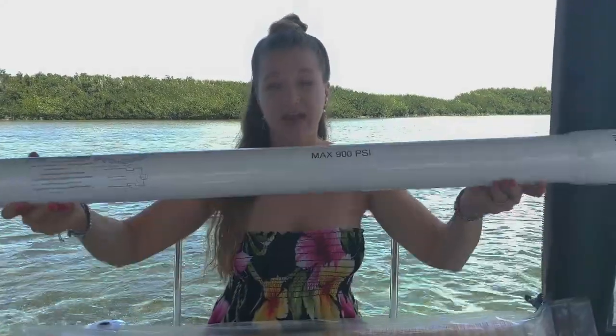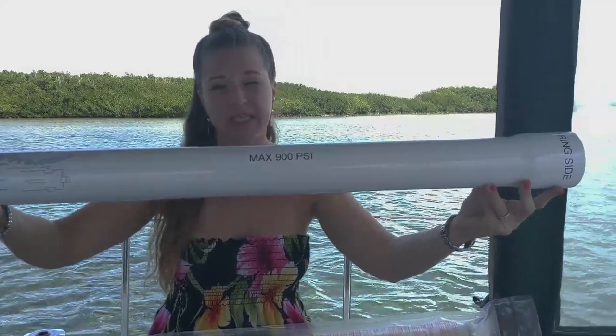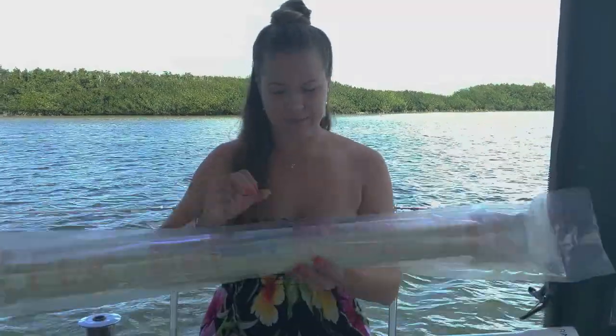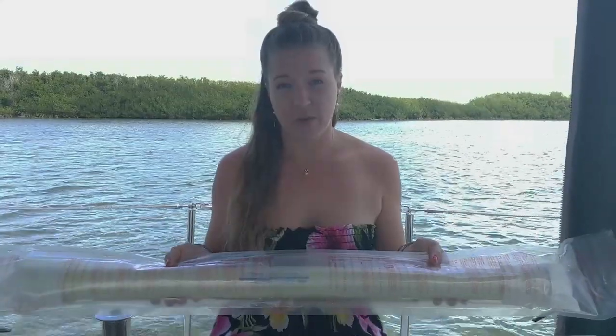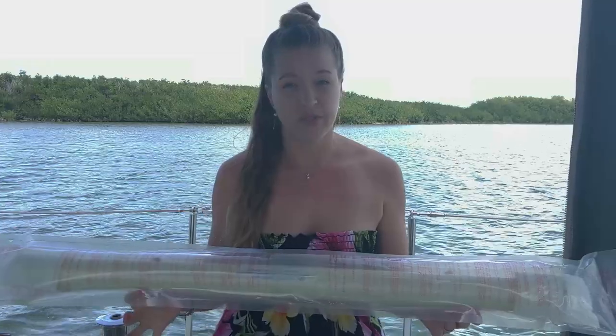After the high-pressure pump comes the membrane housing — it's directional, with notes about the o-ring side. Inside that housing is your membrane, which is what actually does the desalinating. The high pressure pushes water through this membrane and pulls all the salt out. It's a fairly generic piece you can get at almost any hardware store or online, though it is sun-sensitive — don't leave it out in the sun, it will cause damage.